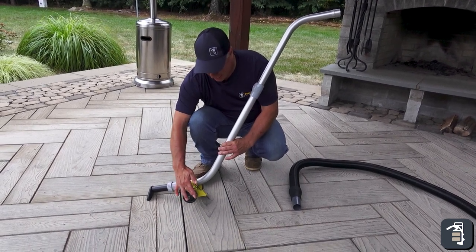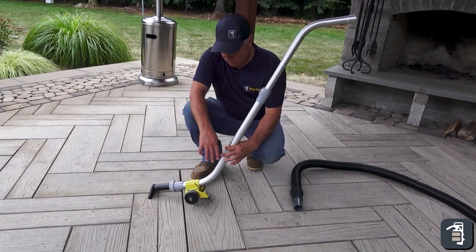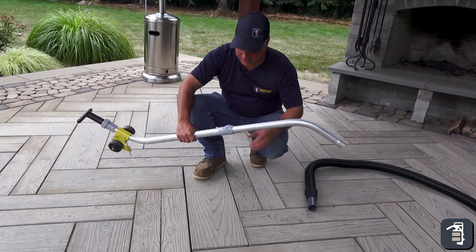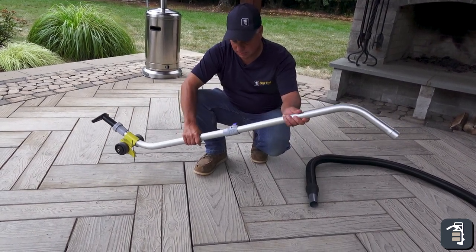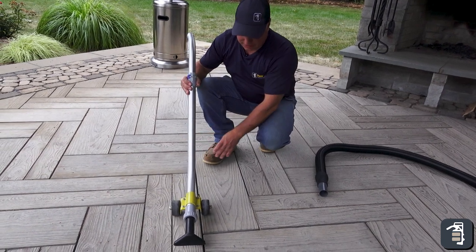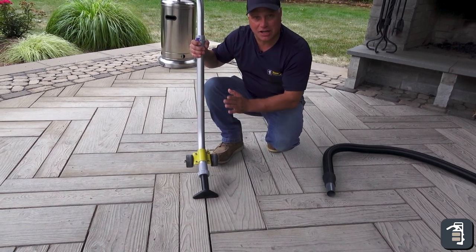The wheels are a guide to ride onto your pavers for the joint depth to be adjusted. It comes with a handle which automatically hooks to your vacuum hose, so it just automatically hooks to a shop vac. You can adjust the height for the hose, whether you're short or tall. It drops right down in — you scrape out your joint, then you simply vacuum that joint out.